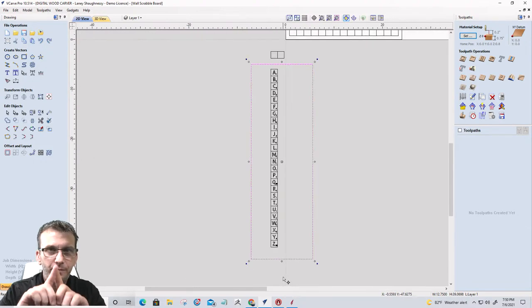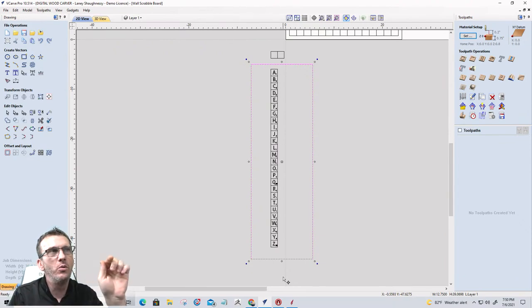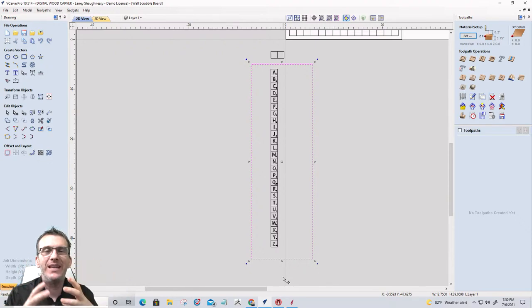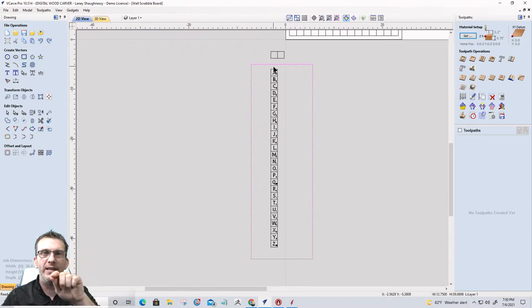Now, it's crucial that either the width or the height of my box is relative to the size of my tiles, to keep the aspect ratio the same. What I mean by that is my tiles are 1.375 by 1.375. If I take that 1.375 and roll that decimal over one time to the right, that is 13.75, right? And so my box width, or height, whichever is more appropriate, needs to be 13.75, or roll that decimal over again, 137.5. If I keep rolling that decimal point over to the right, as long as one side of my box is relative to my object sizes, then I can scale them appropriately.